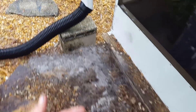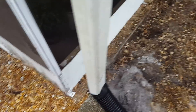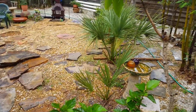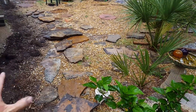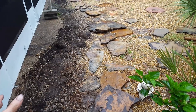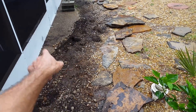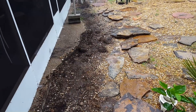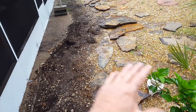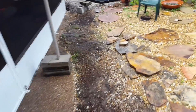We'll continue right around the side, right up to the corner of the lanai and put in our system. As it rains, all this water coming down here is going to drop right into our system, right through the gravel, right through the styrofoam. We're also putting a catch basin here at that curve, and another catch basin around the other side, so all the surface water just drops directly into the system, over to the sump pit, and the sump pump lifts it up and sends it out to the street.